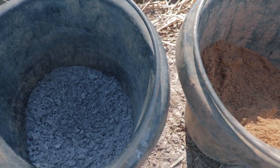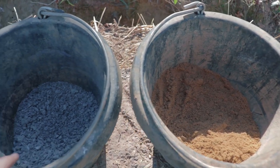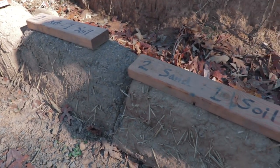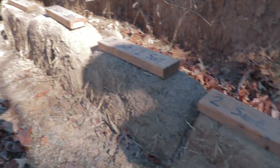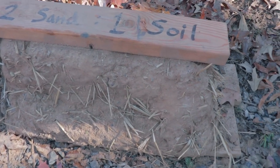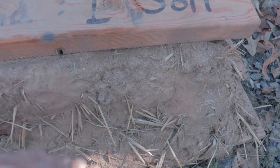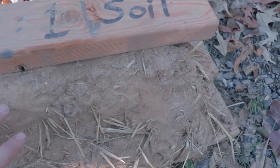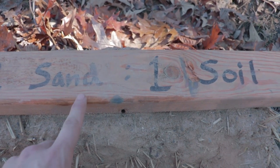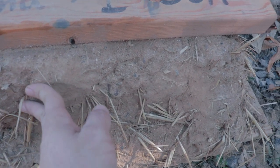Masonry sand is typically used for making mortars. Here are the four samples we made in our October workshop, and you can see the ratios labeled on top. I'm going to start from worst going down to best. I expected this first one to be the worst combination, but to be honest it's not a bad cob. There are a few things that are not great about it, mainly the high aggregate ratio. This was two parts sand to one part soil — that's quite a lot of aggregate, at least with the local soil here.